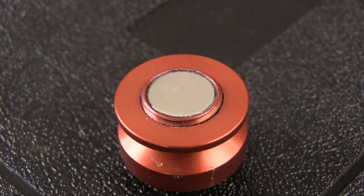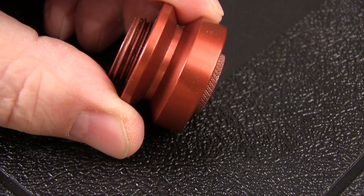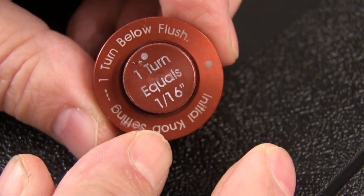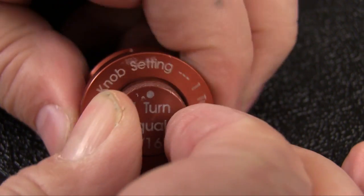The target magnets are built into a precisely threaded central core. The flat area at the bottom of this V-groove is exactly the same width as the laser beam, and that makes this outfit very precise when you're setting something up. To adjust the targets we turn the body around that core, with each turn producing a sixteenth inch of change, so you can get very precise with these targets.